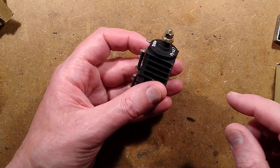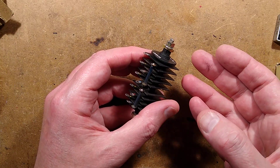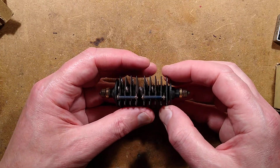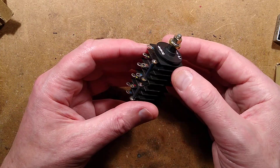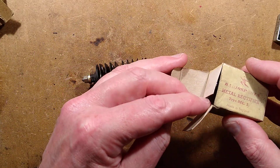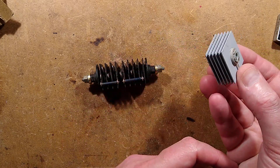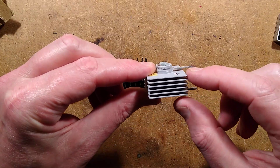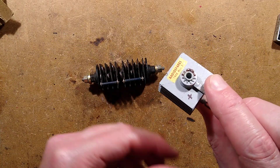There is a downside: each of these plates is a diode, but it's only rated for around 20 volts in normal use, with a maximum voltage of 25 volts. It's also very low current — I would rate this rectifier a few hundred milliamps. For a higher voltage diode, you stack them in series. This example has six plates in series, which would make this roughly a 120-volt diode.